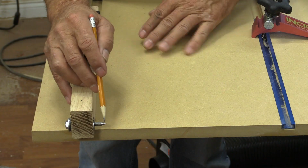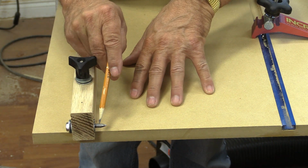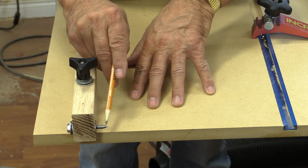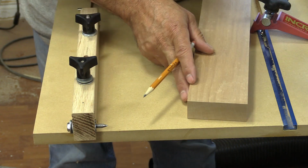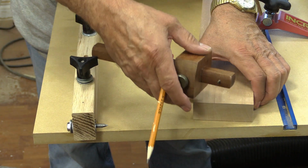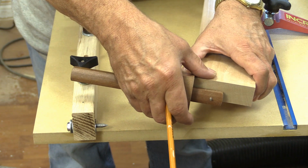We're at the table saw, and this is my tapering jig. And the part that holds the bottom is this little pin right here. And what I need to do is drill a hole in the bottom of the leg so that this little pin will go through. I need to mark, because I want this to be 2 inches at the bottom, I've set my marking gauge to 1 inch. So I can just scribe that.